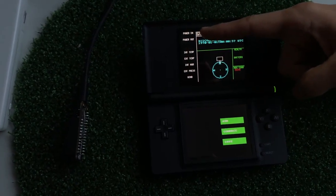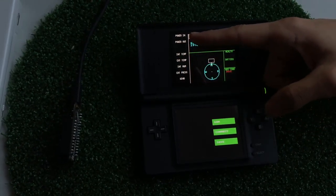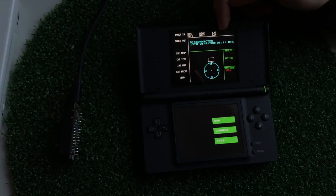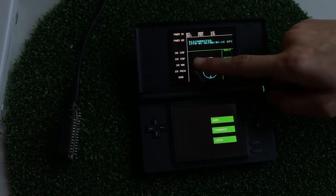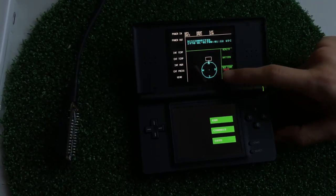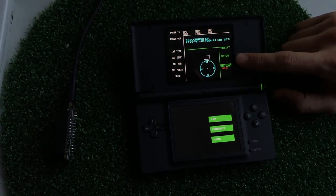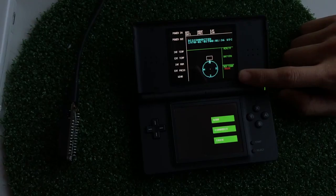You will also see the data from the rover's sensors. The most important ones: power in — power generated by the solar panels — and power out, used by the motors. GPS information at the top, the time and status again, and temperatures, humidity, pressure, and wind. There's also a little compass here that will change in function of the rover's heading. A health status that currently just displays the percent battery left, the battery voltage, the Nintendo DS Wi-Fi connection, plus some packet information.